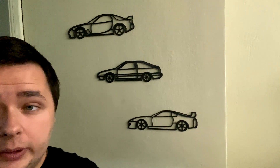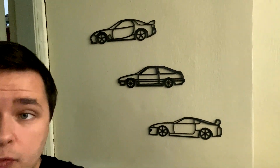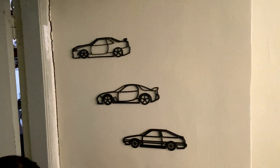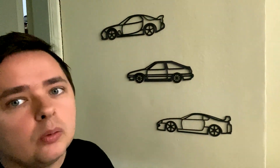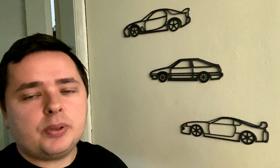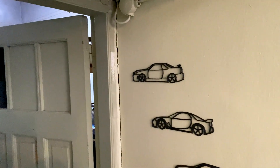I didn't want to make them too small because the original file comes at almost half the size. These ones are scaled up 60% from the original size, so you can adjust however you want. You can make them bigger if you slice them in your slicer. These are 60% bigger — you can go small, big, or whatever you want. If you go too small you may lose some details, so I don't recommend going more than 20% smaller than the original files, since the lines are very thin.